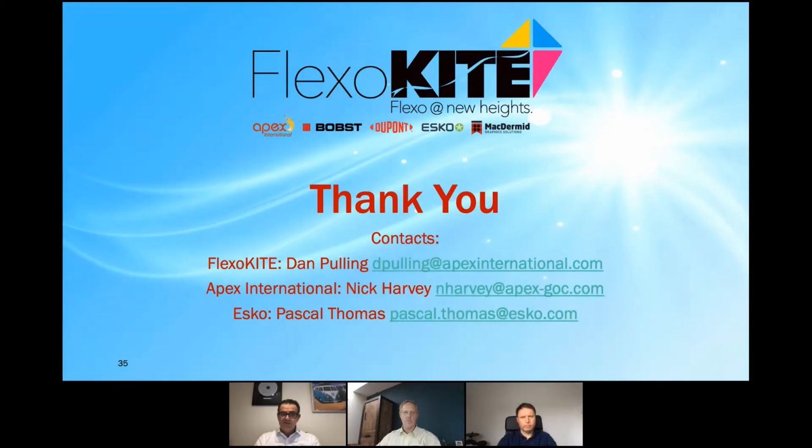And what we hope to do, and we will do moving forward, is create some kind of internal project that we can assess with different anilox rolls or banded anilox rolls with all the patterns that Rob can provide, and we should be able to get a best guess, well, guess isn't the right phrase, but the best calculated screen for that particular anilox. Like you say, if we work with all the different engravings within the GTT range, we can apply those screen patterns to them, and then we can build some sort of matrix in terms of what type of opacity you could look to achieve with those combinations.